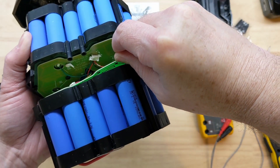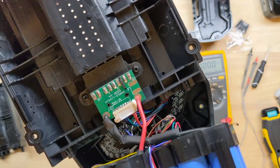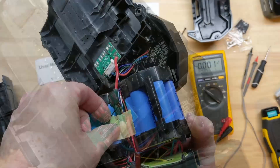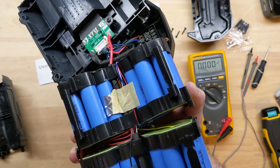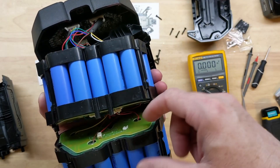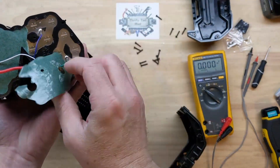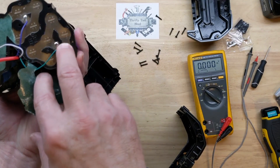The transistors are on the back side, similar to the EGO. There's a trace fuse there — that's how they did it as compared to EGO. There are NTC thermistors for temperature monitoring on the pack, on two different halves, as well as at the center of each cell end set, which appears to have a pin junction they're monitoring there. The spot welds look really good.